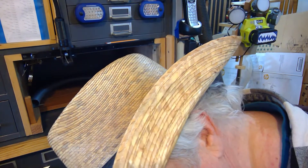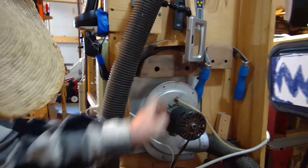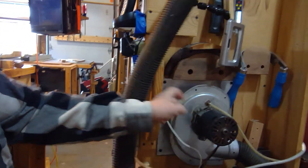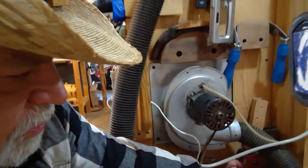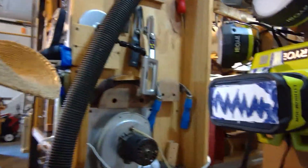Let me show you real quick — let's go over here and take a look. So we're on the side of it now and you can see the blower motor here. Just four bolts hold the whole plate right up against the side of this thing. I lined it up to the hole I drilled with the PVC pipe — that's the inlet and this is the outlet. What I want to do is put a two-inch PVC pipe on here with a T-connector and get a jar on the bottom so anything heavy coming through will fall into the jar.